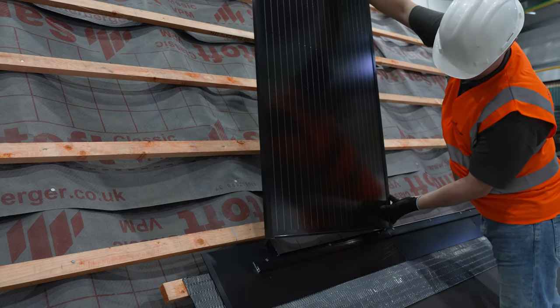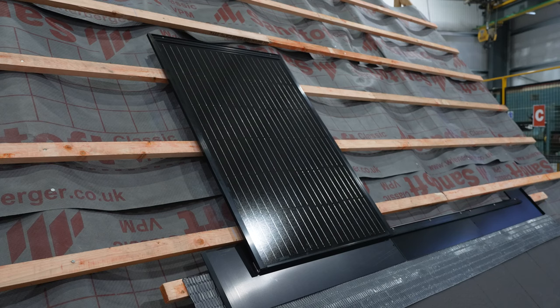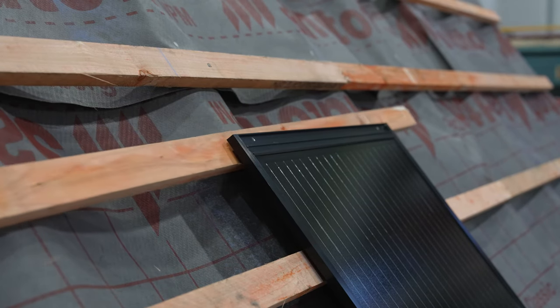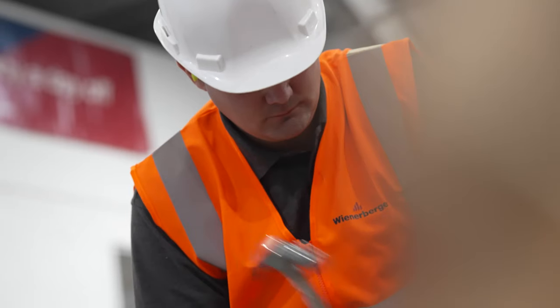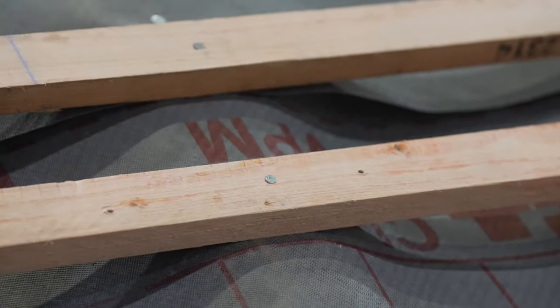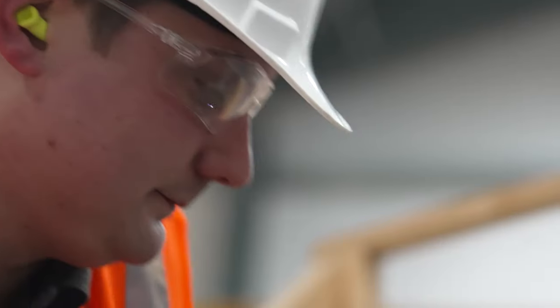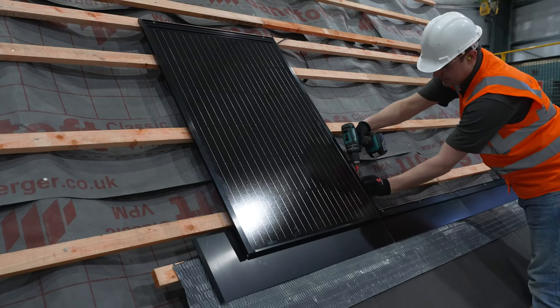Offer the panel up to the bottom edge bar at around 45 degrees and lower it down until it engages and locks in place. Make sure the cables at the top of the panel do not foul on any battens and that the panel sits flat. The bottom edge of the solar panel should be flush with the bottom edge bar. With the panel in position, check to see if the fixing holes at the top fall on a tiling batten — if not, install an additional batten the width of the system. Using the self-tapping screws, fix the panel securely using both fixing holes. Next, hook the batten brackets into the grooves on the underside of the panel — you will feel it engage when correct. Install two brackets on either side of the left hand panel into the top and bottom most battens, using two self-tapping screws per bracket to secure into the batten.